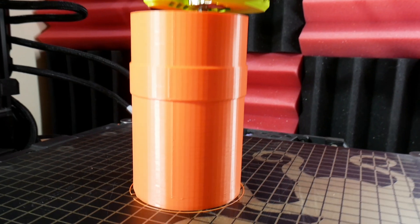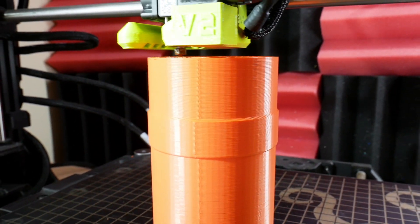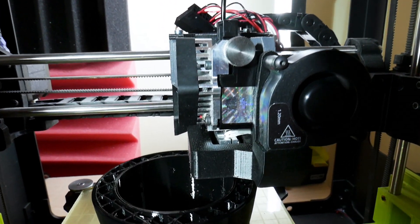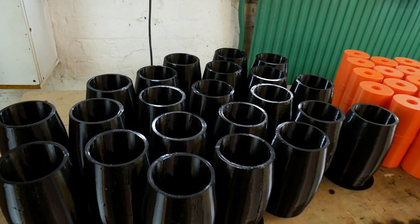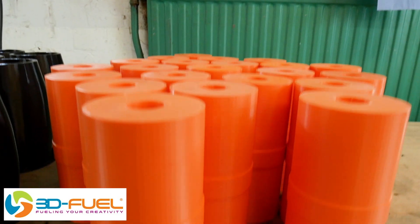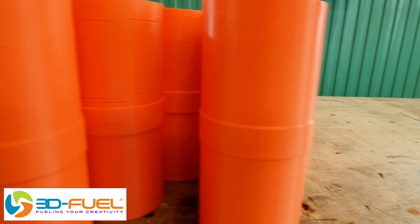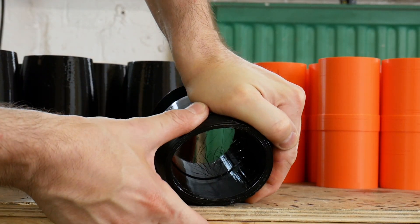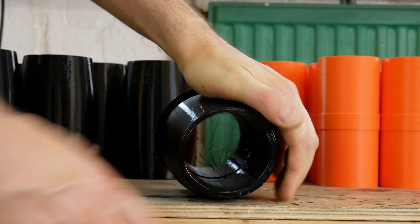First I've got to make two massive omni wheels, each one with 12 little wheels, so there are 24 of these wheel hubs to 3D print. There are also separate tyre parts printed in very high density TPU — so that's 24 tyres and 24 hubs. Thanks to 3D Fuel for the filament for this project. The tyre parts were printed with a 1.2mm nozzle, which makes them extremely tough, and I need to insert them now.